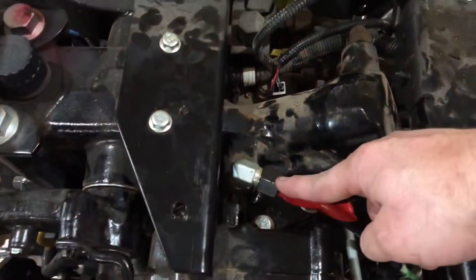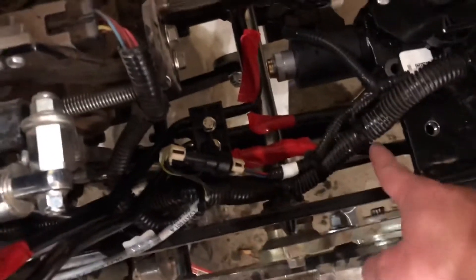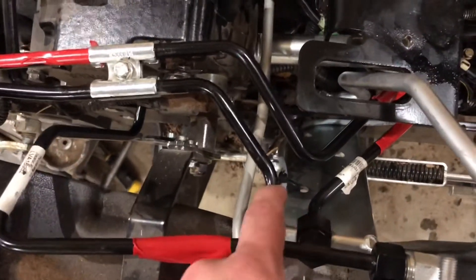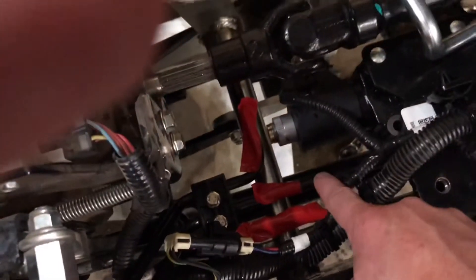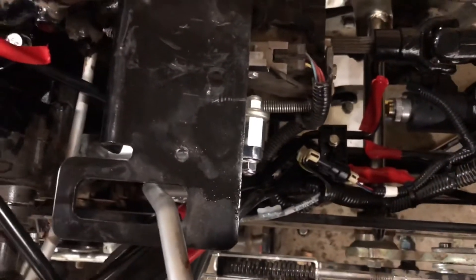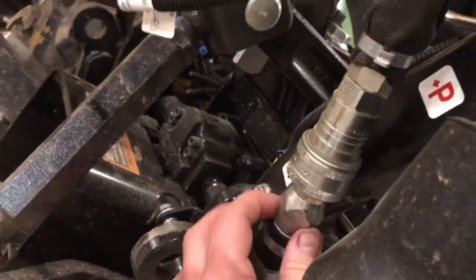So I've got all the plumbing done. I put red tape on the lines that I actually had to change. This one goes down to here. I had to change this tank line so it could have the T plug on it — you can follow it down to the middle. And then the one on this end is the Power Beyond loop. The one that goes here is the one on the bottom that has the male plug.